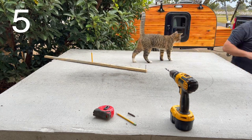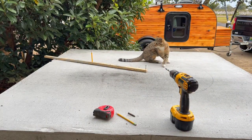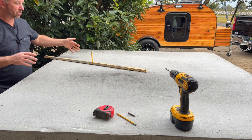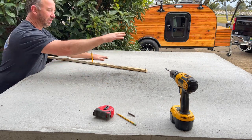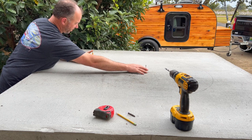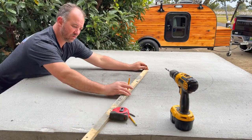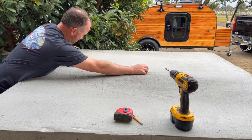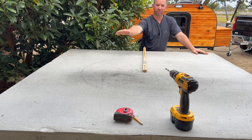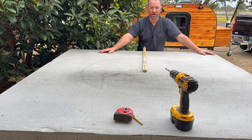This is just going to give me a rough pattern for whenever I'm laying out for the insulation layer. I'm looking at doing an inch and a half to two inch insulation layer of vermiculite and concrete. That's supposed to insulate and keep the heat from going down into my slab and losing it out of the oven. So it performs two functions: protecting the concrete and retaining heat into the oven. That's my basic template — 42-inch piece in here. We're going to move on and start forming up for the vermiculite.